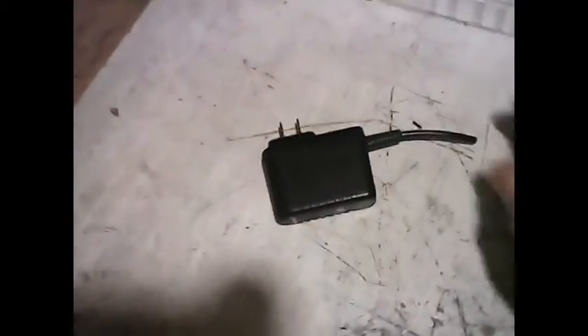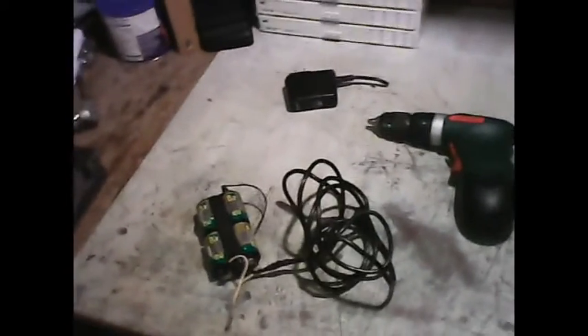I'm taking the original batteries out of the case, getting rid of those because they were burned out and no good, and eliminating the battery charger itself — using the cord off the charger that would go into the drill, converting this over from batteries to just simple wires, and connecting those to a separate bank of batteries. I now have the convenience of using the drill again, plus the ability to switch out batteries to a different kind if I want. I can unhook the cord, store it away separately, and now I have my drill back and can use it again. Thanks for watching, bye.